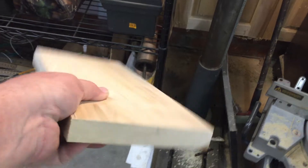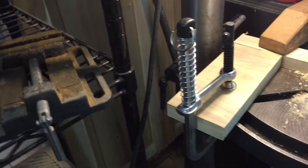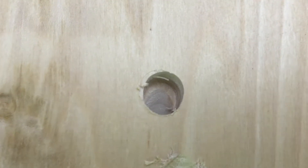I went ahead and cut four pieces about this big for this carpenter bee trap. Essentially what you have to do is make a hole in each side up near the top that's pointing upward — you can see in there it points upward. It's a little tricky; you can do it with a hand drill but I'm doing it on my drill press. You drill almost all the way through, then flip it over and drill a flat hole straight in. So as the bee is sitting inside he can't see out, but when he's outside he sees light and crawls right up in there into the box area.